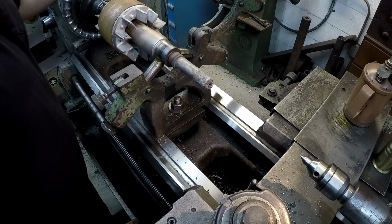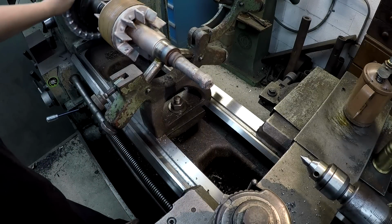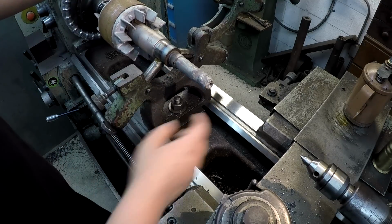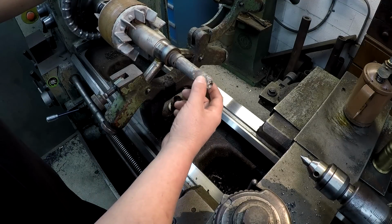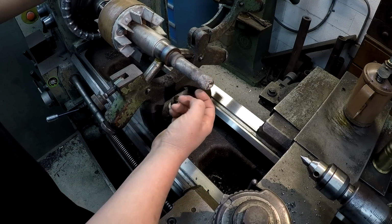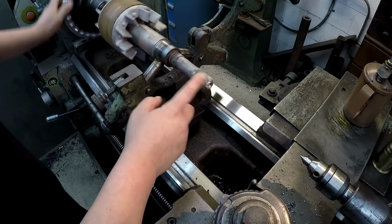Well, I let this thing cool down. And the end out here, the impeller end, I know it looks kind of bad, man. That's not too pretty. And I think I actually lost some there. The problem that I was finding on this end right here, you know, it's basically hollow because it's drilled and tapped, is keeping the proper heat range. And I was finding that as I was trying to build it up, it was getting too hot and the material was trying to roll and flow down. And it looks like it might have just dripped off right there. I'm not sure. I might have to redo this impeller end.